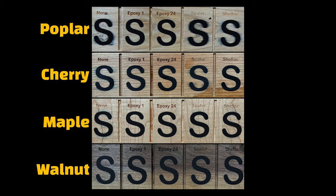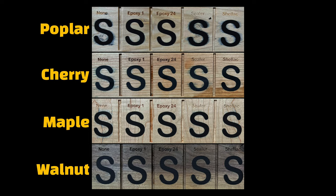I did notice when I applied both the sanding sealer and the shellac, the poplar seemed to absorb them a lot more than any of the other woods — that certainly begs the question if an additional coat or two would have helped. The final picture here shows all of the tests side by side. Clearly, poplar is the universal loser, with only the well-cured epoxy providing protection. Generally, the walnut is the universal winner, showing the least signs of bleeding of all the woods. Maple is probably in second place, with cherry being third. I was fully expecting maple to fare worse given its light color, but I guess its additional hardness allowed it to fare better than most. In terms of which method worked best? The fully cured epoxy seal coat clearly provided the best overall results, hands down. The short cure epoxy worked for some woods, but not all, which is a little disappointing. I was very shocked at how poorly the sanding sealer performed, and the shellac came somewhere in the middle.